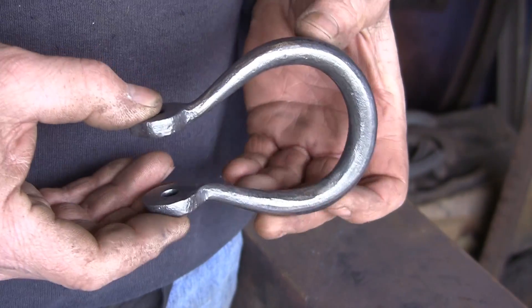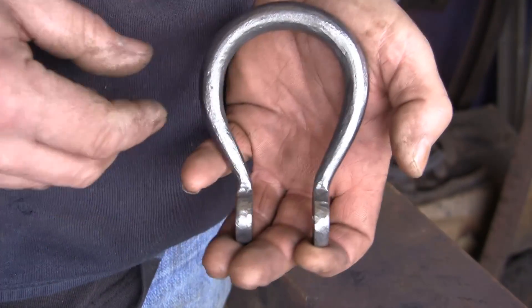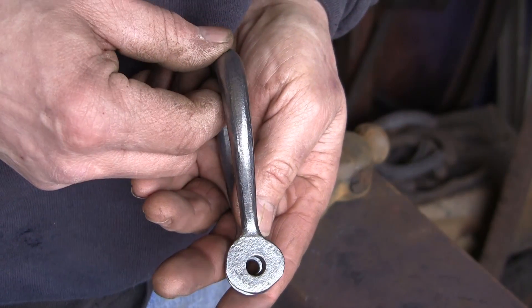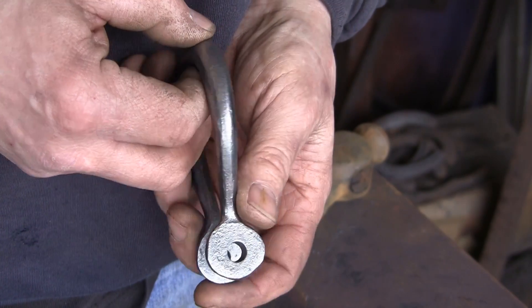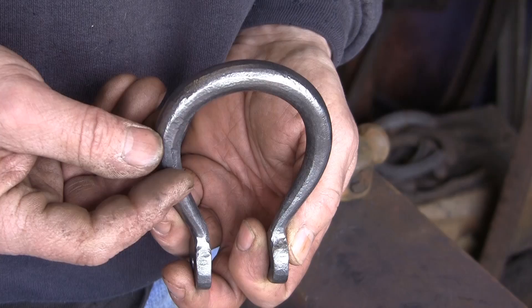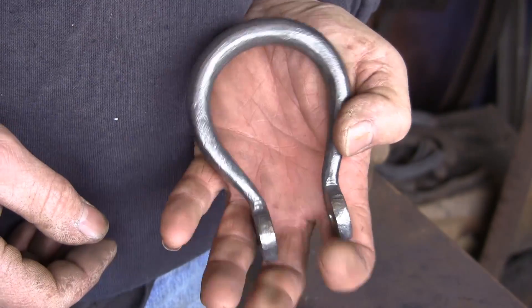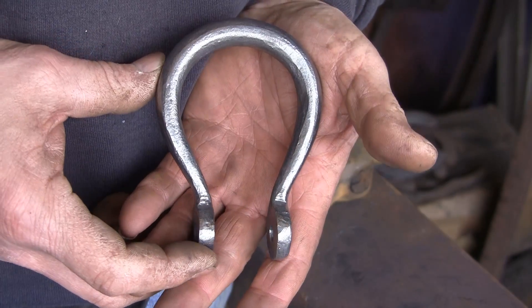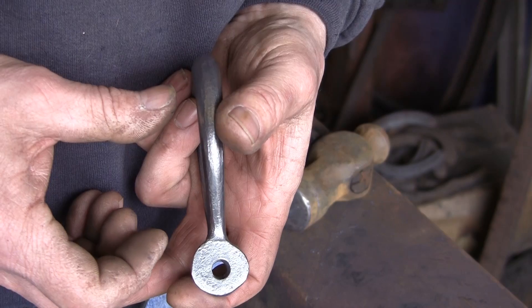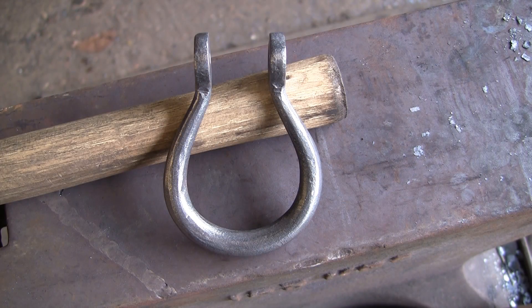All this has had is a wire brush - no file, rasp, or grinder anywhere near it. All hammered and wire brushed up. Considering I haven't got a lot of time today, even the holes line up. I could have tidied those up a bit but I don't think that's too bad as a demo. I hope that's what Albert Dog 101 was after. It's quite a good demonstration because it shows you can use all sorts of different skills: hammering, upsetting, and punching. Nice little bow shackle - thanks for watching, hope you enjoyed it, catch you on the next one.